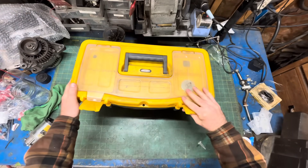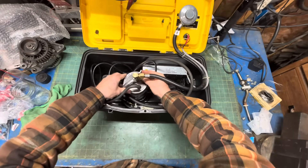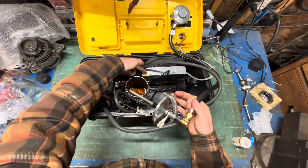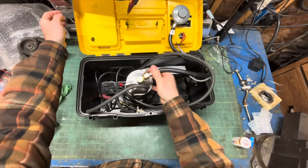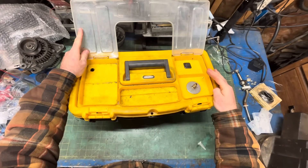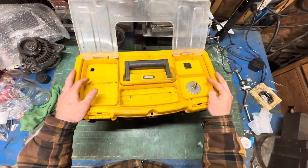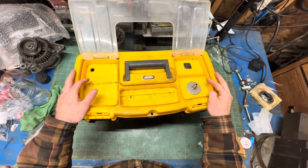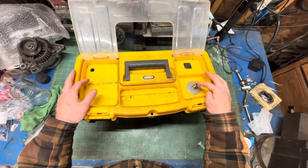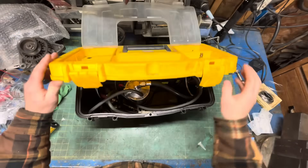I made this when I was a kid. It's the cheapest Harbor Freight toolbox they sold and a modified Harbor Freight paint sprayer can. It's got a beefy 12-volt switching power supply, a propane grill regulator, and an air fitting. It's paid for itself in diagnostic time a thousand times over since high school, finding vacuum lines I forgot to reconnect and showing me exhaust leaks I didn't know I had. Whole thing was like 30 bucks — back when brass fittings weren't $9 a piece and before Harbor Freight got all cute. Easily the most competent thing I've ever personally created.